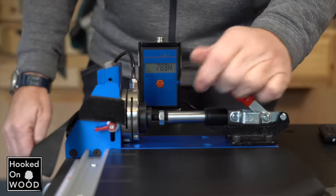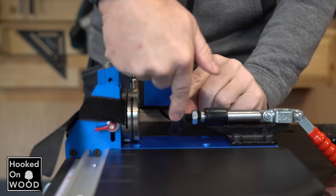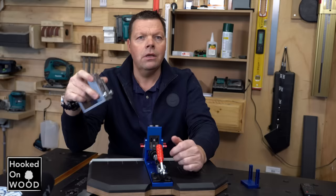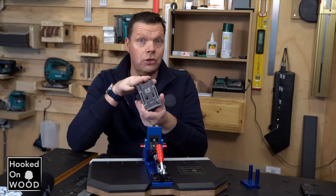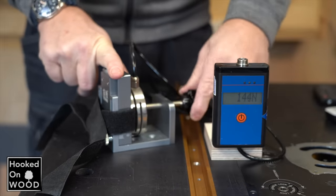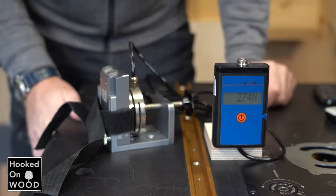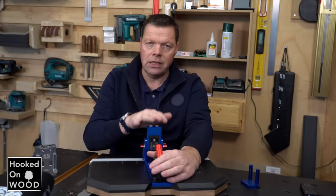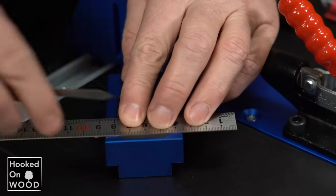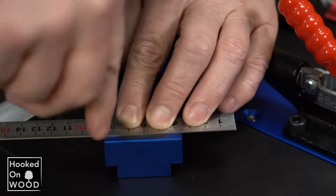Even with 75 kg of force it feels very stable. But I think 75 kg is overdone, so turn it between a quarter and a half turn — that will give you enough force. If I compare that to the Yomo version, it feels like you do not want to clamp it further than 30 kg. Still, that is strong enough to hold most wood in place, but it is a good thing that this XK2 can go a bit further. Before I start drilling holes, I place a mark in the middle piece to see how much deviation there will be after using it for a while.